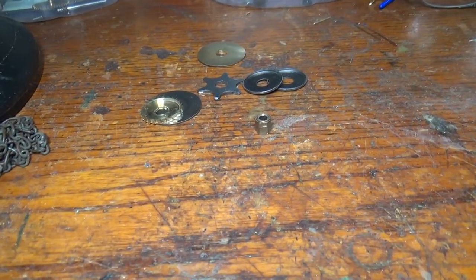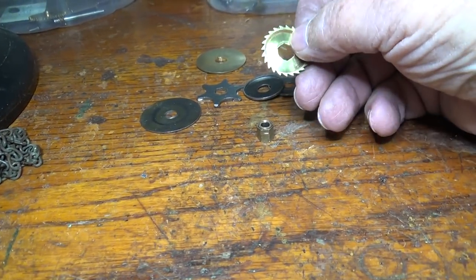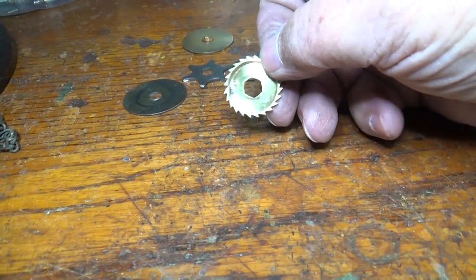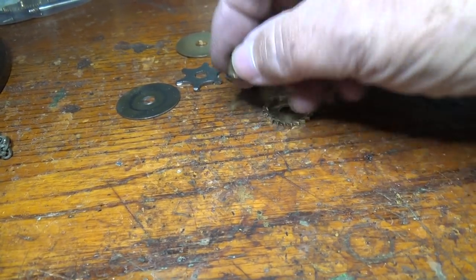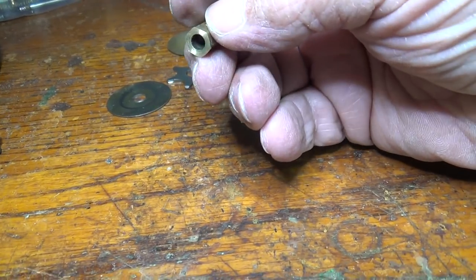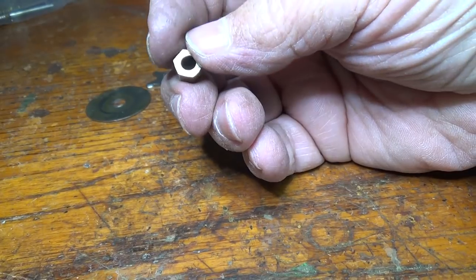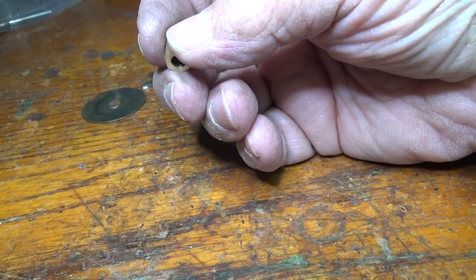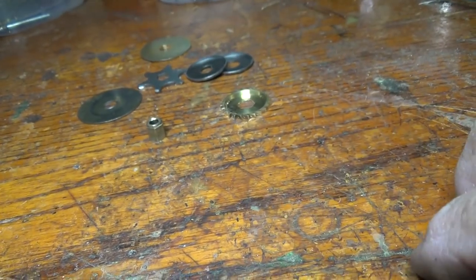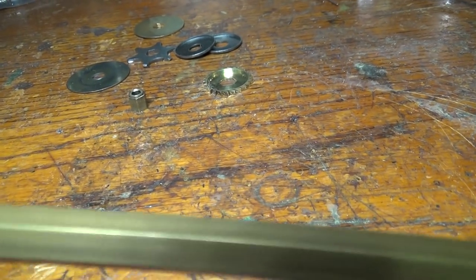Our next step is gonna be getting the chain wheel back together with the one that we fixed the tooth on, the ratchet. And here's the piece that holds everything together. It's hexagonal brass, and it's taken me a while to find a piece that's the same size. It's 9/32,